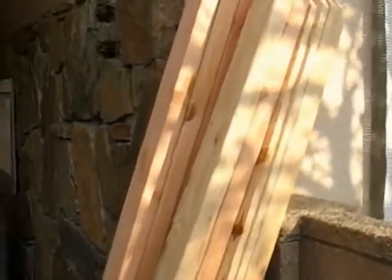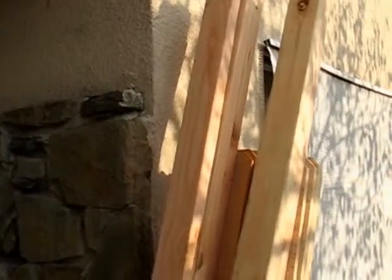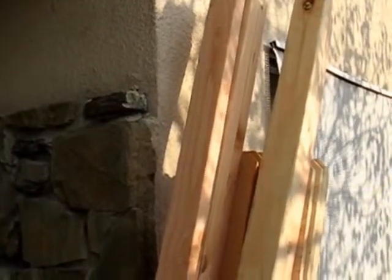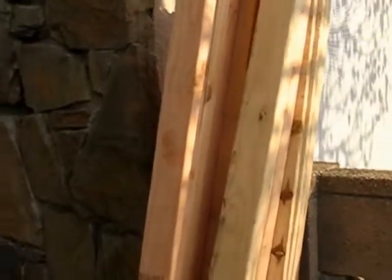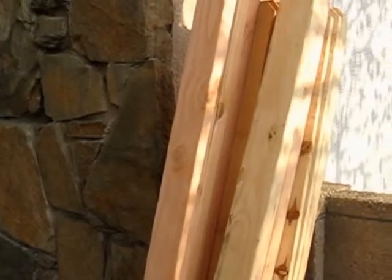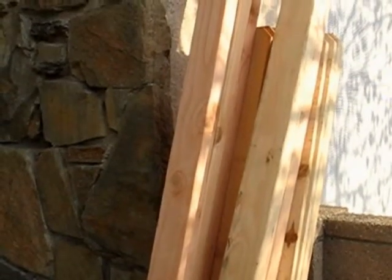Your needs may vary a little bit from what I've got here. In my particular case, I have 5 of these 2x4s. They're basically 8-foot 2x4s, although it's about 50 cents cheaper if you get the 92.5 inch instead of the 96 inch. So it's not really 8 feet, but it's a little bit cheaper, and as it turns out, I figured out how I could do all the cutting so that this would actually work in my favor. That's 5 2x4s, about 8 feet long, and 10 fence boards, 6 foot long, 5.5 inch wide, and 5/8 of an inch thick. So now what we're going to do is put some of the fence boards together so we can take a measurement and figure something out.